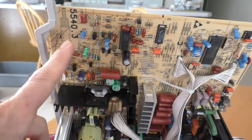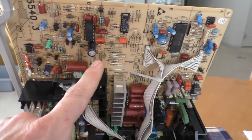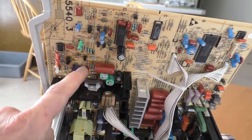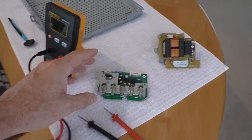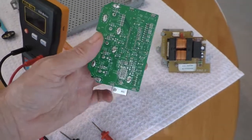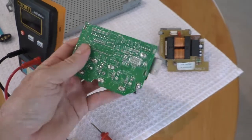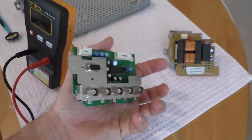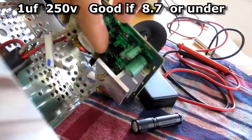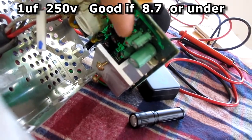I also visually inspected all the components really carefully — all the resistors and other parts — to see if anything looked brown or burnt out, but everything looks good. I resoldered all the VGA pins and the header pins on the VGA board.